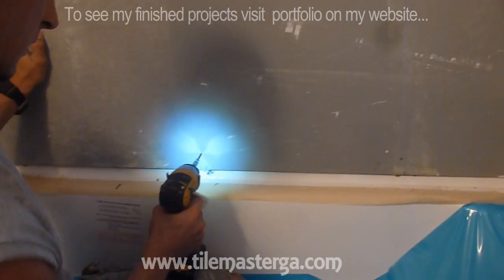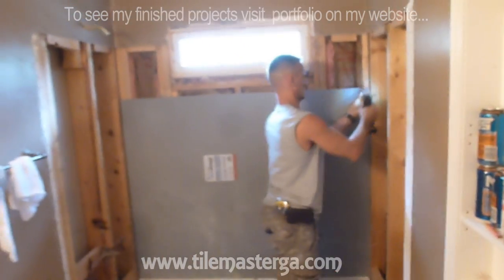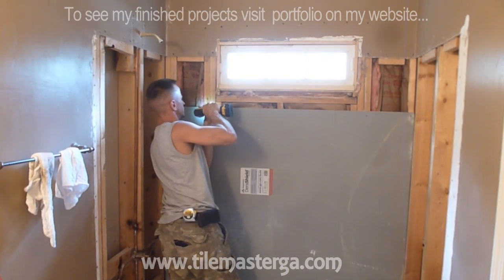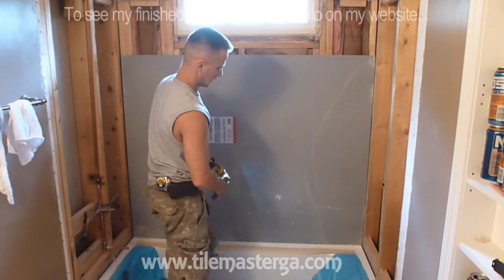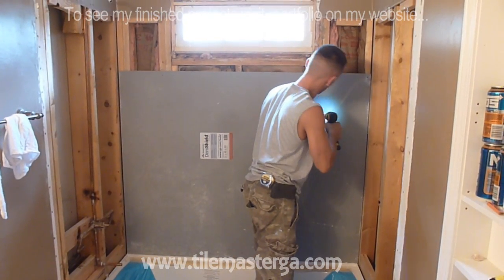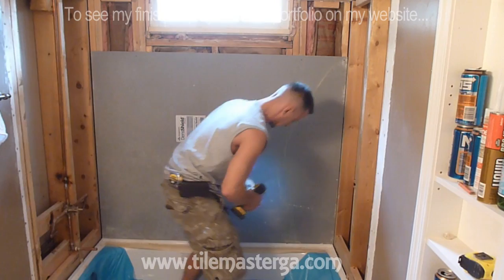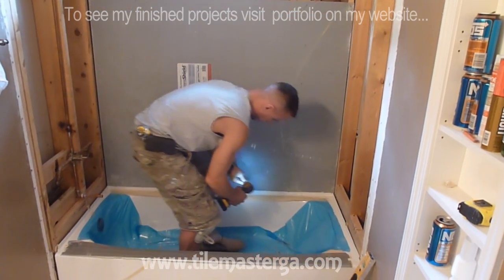And let me put another one here. All right, let me secure it here. Okay, so the board is secured. The next step, I'm gonna put the screws along the studs, and you can do the marks from the start to make this easier for you. I'm not gonna do any marks because at this stage I pretty much know how it goes. And I'm tightening all the pieces, the board to the wood.